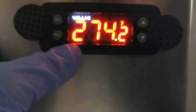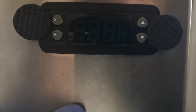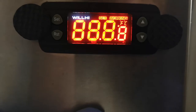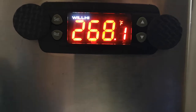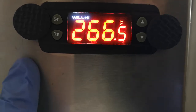You can actually start the press up, plug it in, and then if you hold down the reset button for a few seconds, that will turn off your temperature, so that will stop it from actually heating up in the first place. So you can press stuff with the plates on, they still work, and then hold that down again and it'll come back on. I should say, when you do that, sometimes the thermostat doesn't kick in properly and you've got to move your plates up and down before it kicks back in again. If it's being really weird, just unplug your press and plug it back in again.